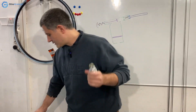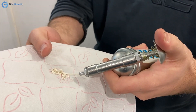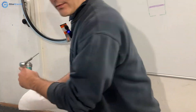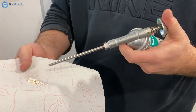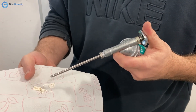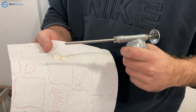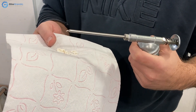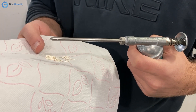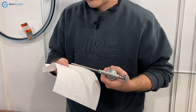I will show how this one works first. It's a simple working principle — you just press on this and the grease comes out, then you release it and it's stopped. Motorex should be doing the same, but it is not. I'm using the same grease, same hardness and everything. When I press on this, I need to press a lot harder and I'm feeling some resistance, and only past a certain point with a lot more pressure does the grease start coming out. Then when I release it, the grease still slowly seeps out — as you can see here at the tip — and that takes up to a minute, and it falls and drips and creates a mess. I cannot just put it on the table without worrying that it will put grease on things I don't want to.